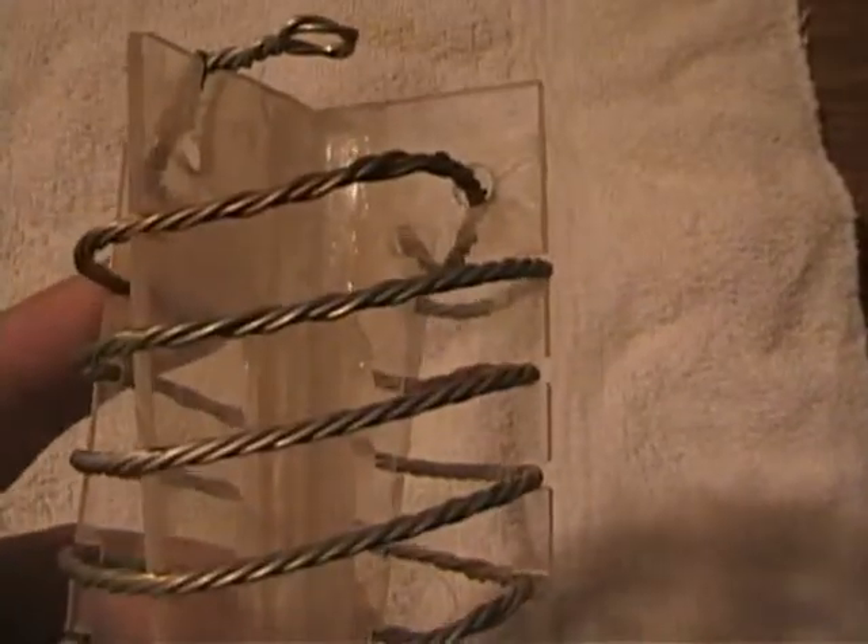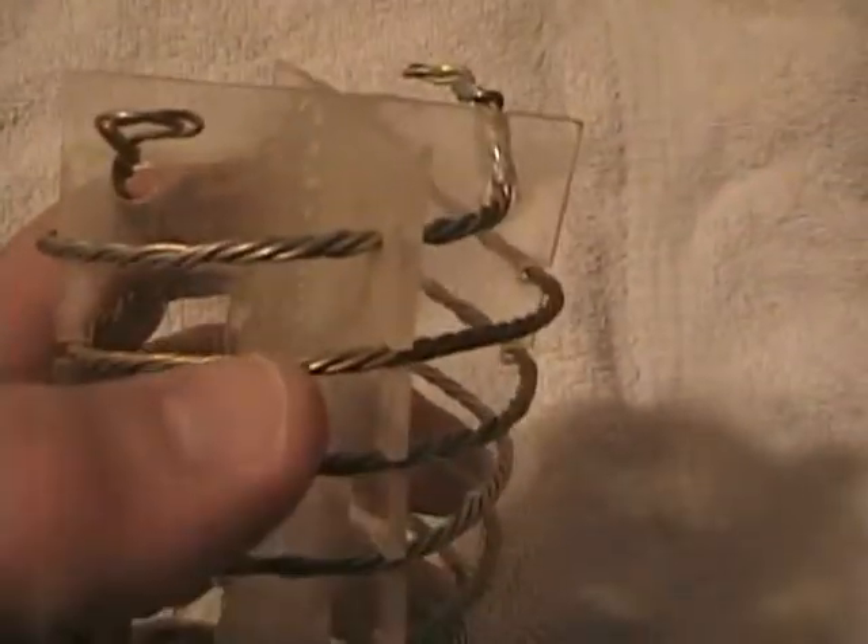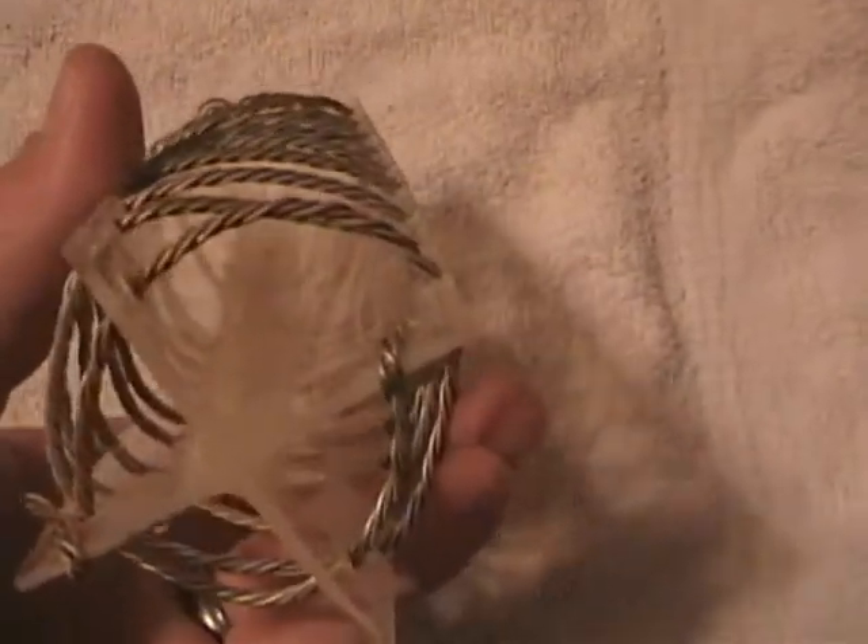The next cell I made was similar to this one, but as you can see there's a difference — it is a little bit bigger. The wires are twisted together, and because I twisted the wires together it made them a little more stiff and harder to bend. So instead of drilling holes like in the previous one — where I drilled holes about every three-eighths of an inch with an eighth-inch bit — I had to notch it, because I could not put those wires through holes without risking breaking the plastic. It was actually a little easier — all I had to do is wrap it around and make sure each wire went into its slot. This is the fourth cell that I made.